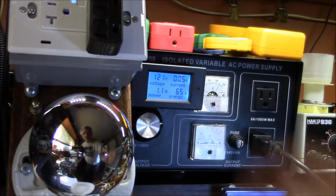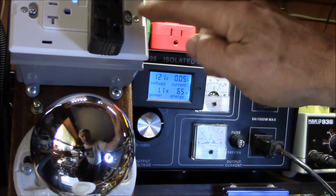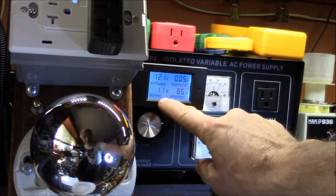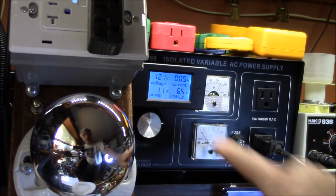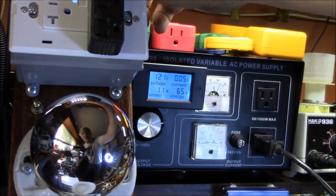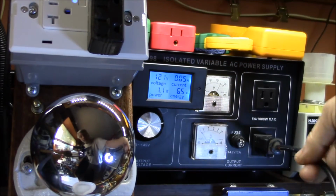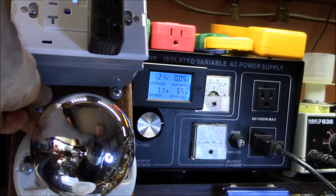Okay, YouTube, wanted to check out the power consumption on this half-mirrored LED filament bulb. So I've got my Z-Wave outlet still in the test bar, so my no-load power, so to speak, is 1.1 watts, so that's what we're starting with. And I've got my test switch set over so it's just running straight from the power line that comes out of here right into the bulb. So let's turn on the bulb, see what it does.